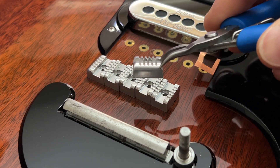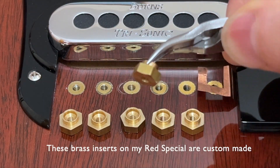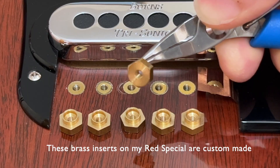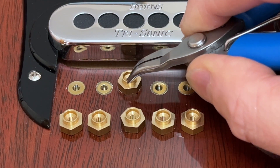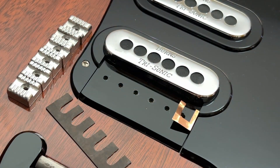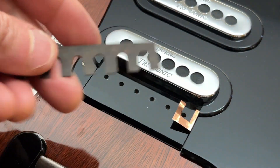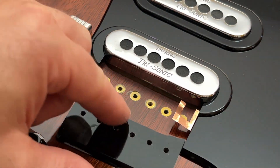The bridge pieces are secured to the guitar body with six BA slotted cheesehead machine screws into brass hank rivet bushings, which act as a threaded insert. Height adjustment is via slotted rectangular shims, which are made from brass and phenolic resin sheet, and these sit on top of a section of the black acrylic, which is separate from the main pickguard.